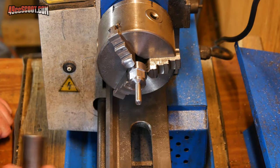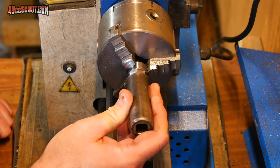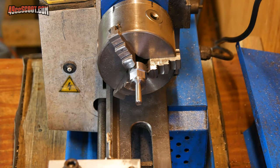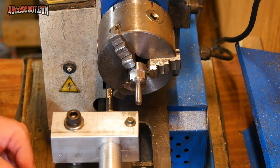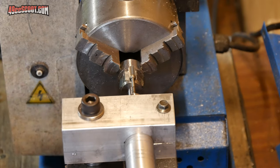I miss making it work with 3/4 or 19 millimeters by just a very small amount. So I'm going to try to change the shimming underneath of my cutter and drop it down about 7 to 8 thousandths of an inch and recut all of the flats again.